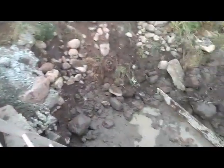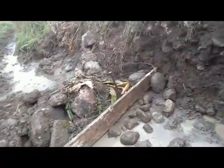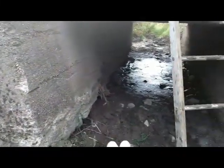It really doesn't hold up our equipment anymore. It's not wide enough. As you can see, it's washing in around it. So we are here. We're going to make it wider, stronger, bigger, better. But today's project, for now, the first step of the first phase, is we need to get concrete underneath, because you can see how the dirt has washed from underneath the foundation, and it's causing the walls to start to slip in.